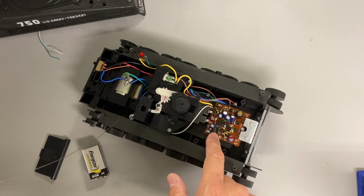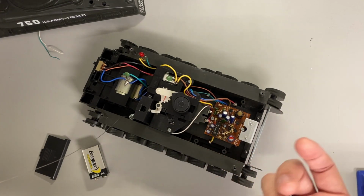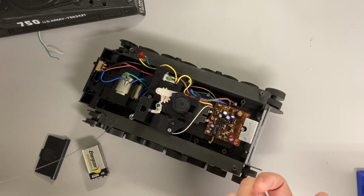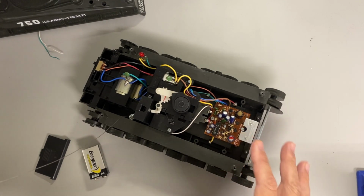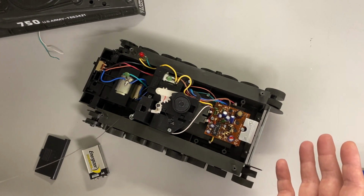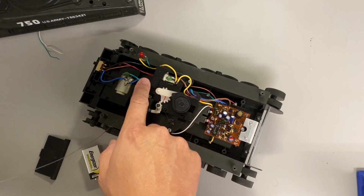And so this chip has three output options, and you're attempting to control forward, left, right, then also reverse, which, you know, fires the cannon and turns on the light. So that reverse circuitry, which is these two transistors here, one of those transistors was starting to leak, so it tested good, but I went ahead and replaced it, and that restored the function of firing the cannons.